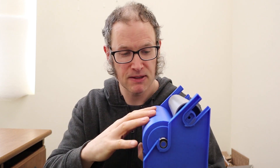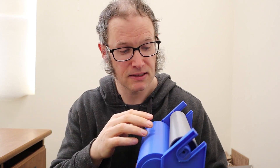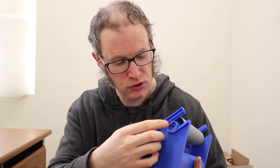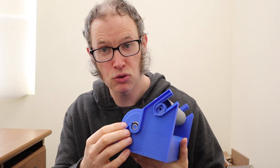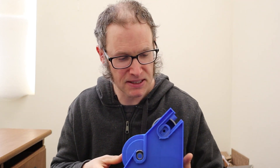The cone has to be tensioned properly against the drum. In the textile industry they tend to use a bunch of weights — those parts are oftentimes either steel or a really dense plastic — but for this I'll be using springs that will pull the cone into the drum. The advantage of springs is it reduces the weight a lot, and since shipping is a big part of the cost, using springs instead of weights makes it much more affordable because the shipping will be less expensive.